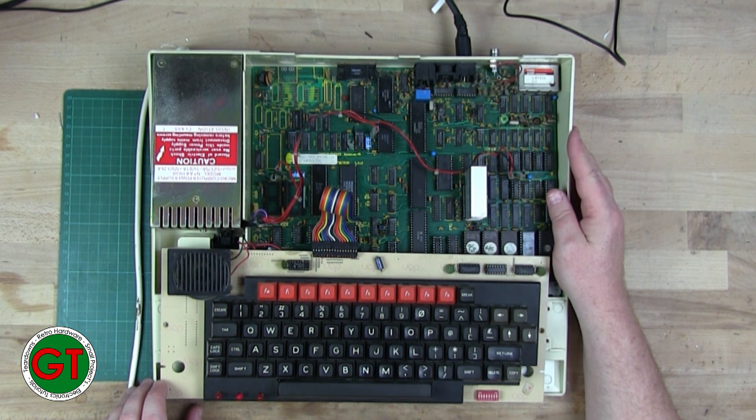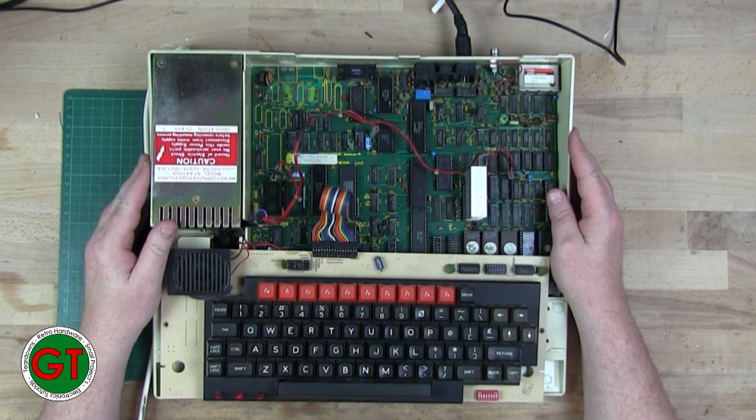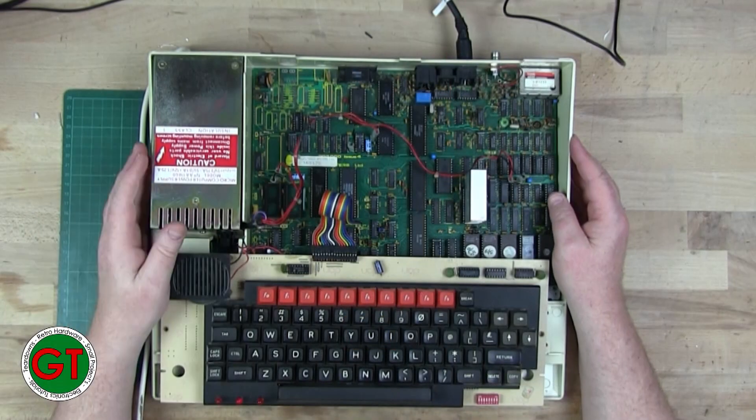For the continuous sound issue, that was a different problem. I noticed the LEDs here were not really functioning, so I looked at the circuit diagram. You can see the LEDs are actually controlled via another chip - this chip up here, which is the 74LS259. That chip was faulty.